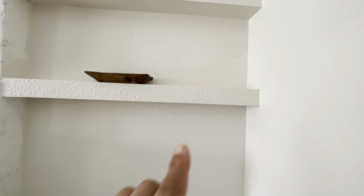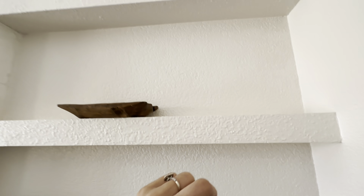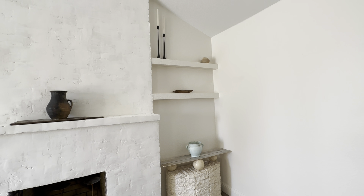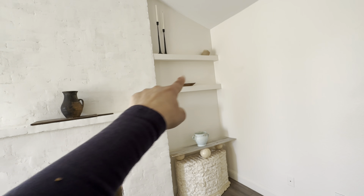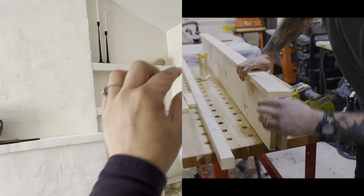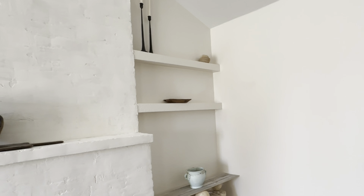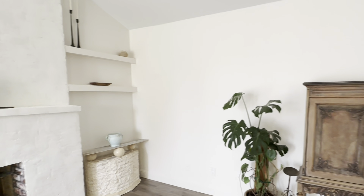If you want to do this project, consider doing the same finish on the shelves as you have on the walls. This is an orange peel texture — not quite orange peel, but it still looks super good. Overall I'm super happy — I spent maybe $30 on the two shelves, and they were custom. If you were to buy custom floating shelves it might have been $100 per shelf. It's super simple — you build a little frame, put two blocks from the wall, and screw the floating shelves on top of the two blocks. They're basically hollow, which keeps them light. Let me know what you think — would you keep it wood, stain the wood, or do the wall texture on the shelves? I'll see you in the next video!